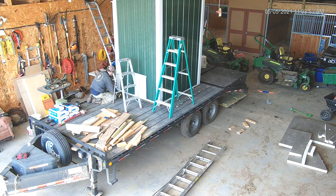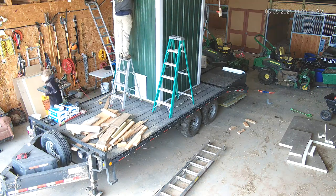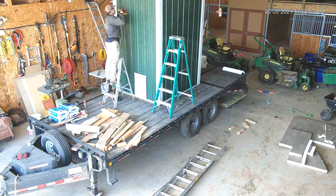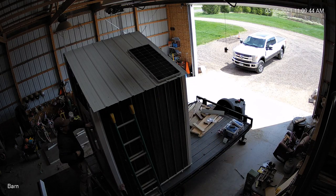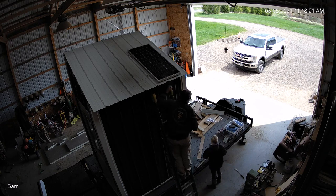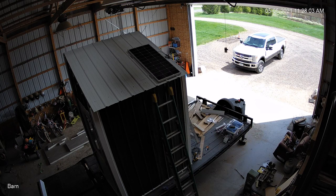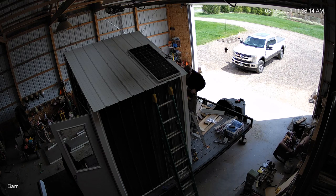It's kind of sad to see this project end, but it's quite the accomplishment. My farmhand should be pretty proud that she made it all the way through and succeeded in building a beautiful coop that'll look nice on her parents' homestead. I'm just finishing up some wiring and getting that vent in — getting it through the steel is a little challenge. The best way I found is to take a two-inch drill bit and run it backwards. We had to take off some of the gable trim and put it back to get the vent in place and run the wires. Sometimes it's a little bit of put it on, don't like it, fix it, redo — the Speltz family likes to do everything at least twice, sometimes three times to get it right.